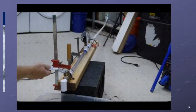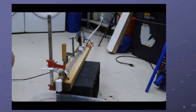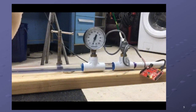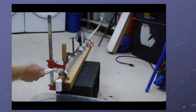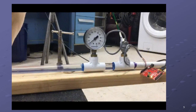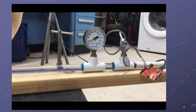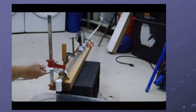There's a good demonstration of water hammer here: he slams the valve closed while moving pretty low volume, and it sends a significant spike in PSI — over 300 PSI. He's probably only moving maybe 15 to 20 gallons a minute. If I remember correctly, it actually broke his gauge.